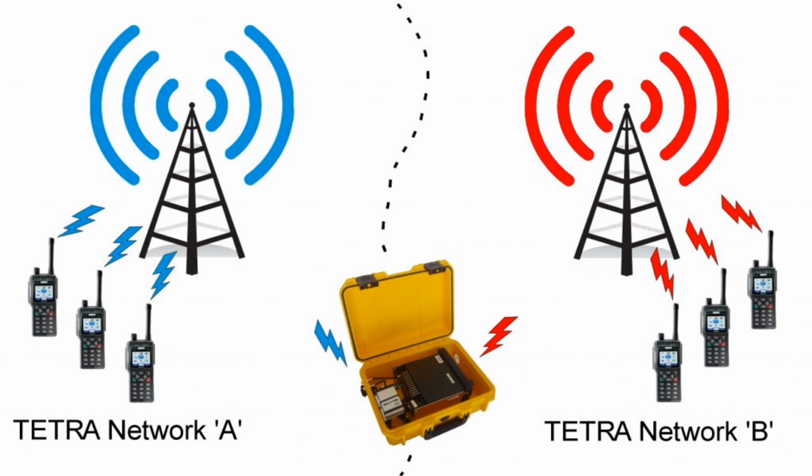Take the RF filter module. It's not just filtering. It's actually quite sophisticated. It has a duplexer inside. Think of that like a traffic cop for radio waves, letting it transmit and receive simultaneously without them colliding. Yeah. And then there's a pre-selector too. That's more like noise-canceling headphones specifically tuned to pick out the right signal, even if the airwaves are crowded. Really helps cut down interference. Crucial stuff. Interference seems like a huge deal here.